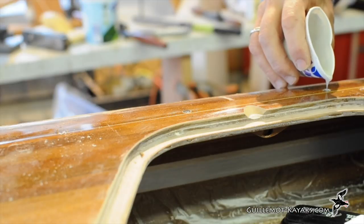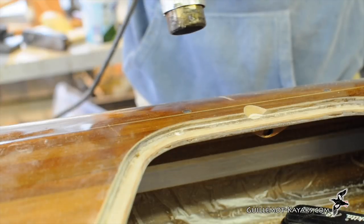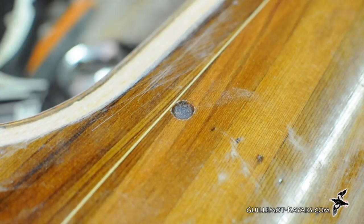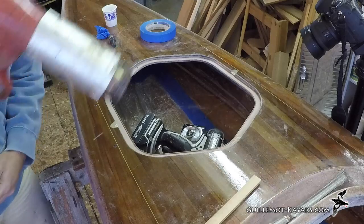This way the grain of the wood is completely sealed, and if anybody tries to over-tighten the bolts, there's a sleeve of solid epoxy to prevent compression of the wood. The freshly severed end grain wants to absorb the epoxy. I promote this by heating the epoxy up with a heat gun. This lowers the viscosity, which allows bubbles to pop and ensures the epoxy can soak in as much as it needs to.